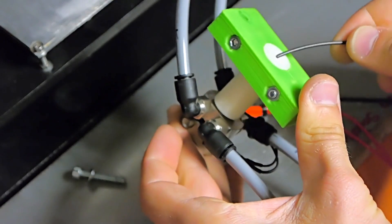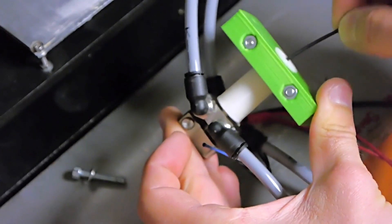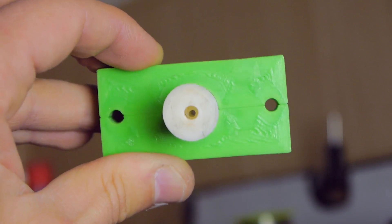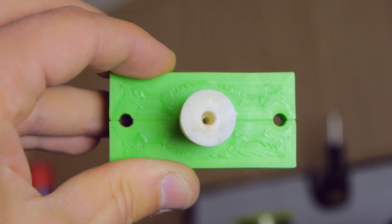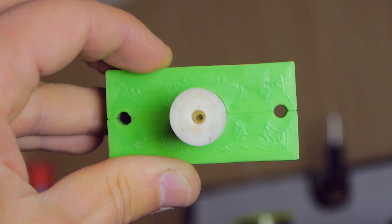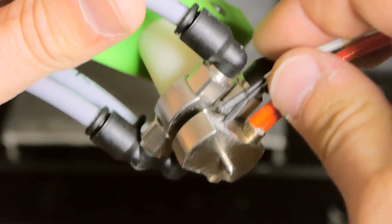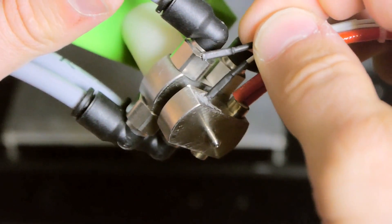When I tried to insert the filament, it still didn't fit in, this time further down the filament channel. So while the mount's bore was probably drilled out in production, it came out pretty far off-center where it meets the stainless block. So I had to open that up some more as well. And then, when I was finally ready to heat this thing up, one of the thermistor's leads had snapped off, rendering the hotend useless.